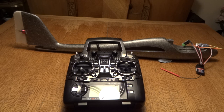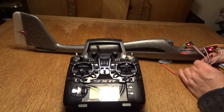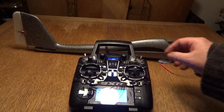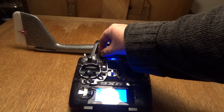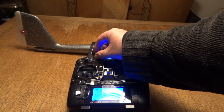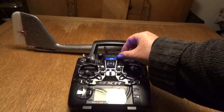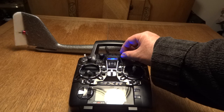If I plug a battery — we're just running this on a 4.8V battery here — powering everything: the receiver along with the flapper. On the transmitter, the rudder works the rudder. This pot on this side is the power — that's 100% power, that's off, and that's like 50% power. And for test purposes this other pot sets the speed — so that's very slow, up to probably too fast.